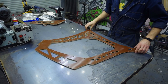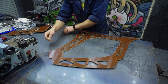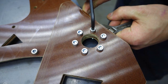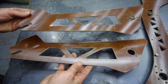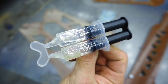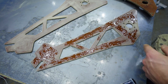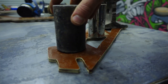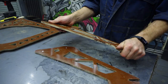Now I want to put everything together, but first without the bridges, as I want to check whether the holes will line up. The only thing I am not satisfied with is the flexibility of the rear wheel attachment — up and down everything holds well, but it wobbles sideways. I'll glue two elements together for more strengthening. For the best coupling I removed the gloss from the details with emery paper. I'll use a two-component epoxy glue. I pressed the details for complete gluing — it's good that the glue is pre-accelerated and hardens in 5 minutes. The details became much harder, but if this won't help I have another spare variant.